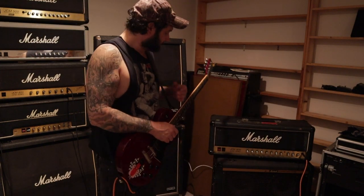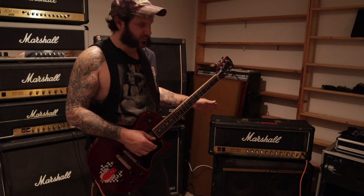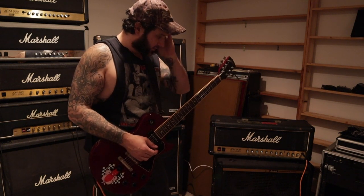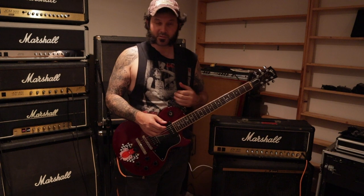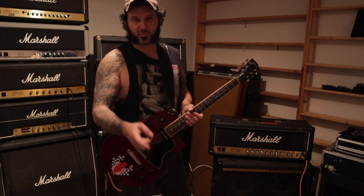That repair went really well. The amp sounds phenomenal as far as I'm concerned — we didn't really change the circuit topology at all. We cleaned up the heater wiring and added that resonance control. Overall I'm pretty happy with the results and I think the customer will be too. Let me know what you guys think about that resonance control in the comments — I think it's added plenty of balls and that effect will be more substantial the higher you go in volume. Thanks for watching, please like and subscribe.